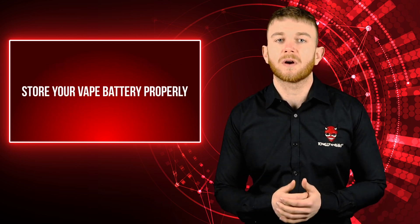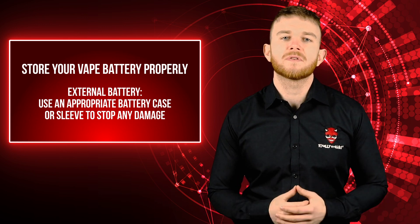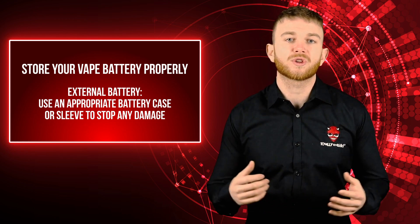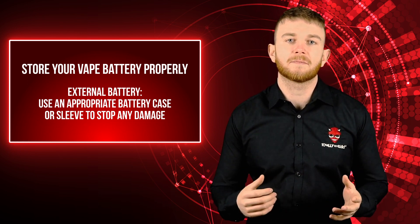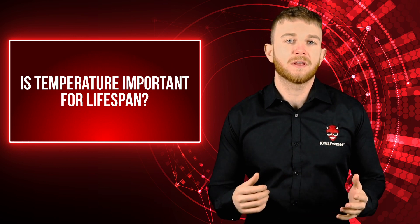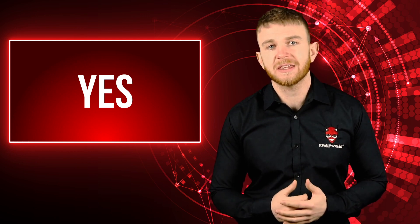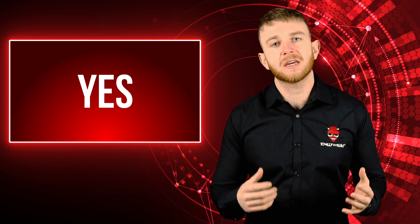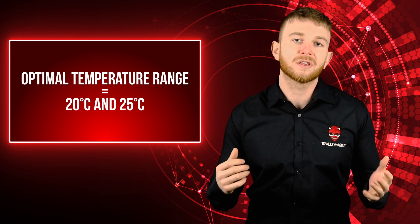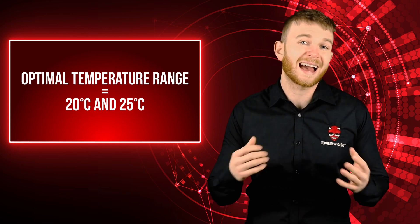It's also important to store your e-cig battery properly. If you have an external battery and need to store it outside of your e-cig, use an appropriate battery case or sleeve to stop any damage to the cell. Storing your e-cig battery in a dedicated non-conductive package minimizes potential risks. Temperature is important for lifespan — extremely hot or cold conditions can affect the chemistry within the cell and cause it to degrade. This is particularly true in hot conditions. The optimal temperature range is between 20 and 25 degrees Celsius. Again, the two biggest enemies for overall lifespan are being stored at maximum voltage for sustained periods and excessive heat.